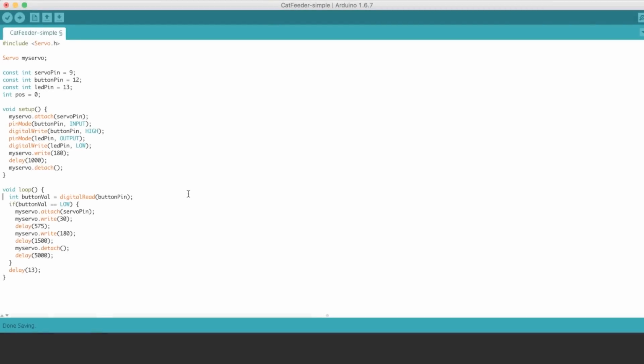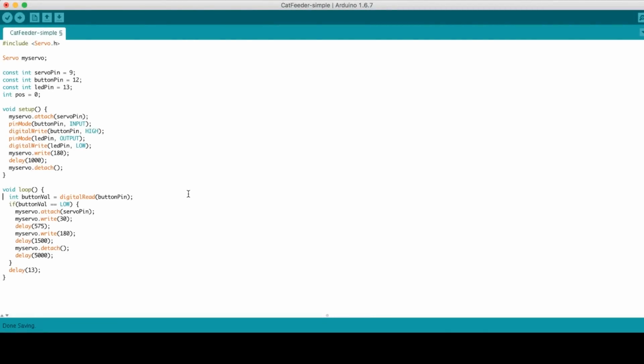Great! I won't go deep into programming the microcontroller, let's just understand the logic behind it. When the button pin receives the ground signal, we rotate the servo to 30 degrees. Wait for half a second and then rotate it back to 180. Also, we need to reconnect and detach that servo because we don't need that annoying buzzing sound in the middle of the night. Link to the code is in the description.